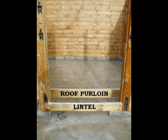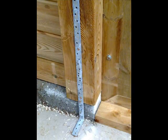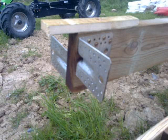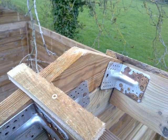to ensure that the doors and purlins fit correctly later. When anchoring doorposts, it is advisable to use heavy-duty wall brackets, 600 by 100 mm. When fitting purlins, fix a small piece of timber to the top of each end of the purlin. This allows the purlin to rest flush with the apex, thereby enabling a safer and easier assembly. Once the purlins are firmly screwed into place, these pieces of timber must be removed.